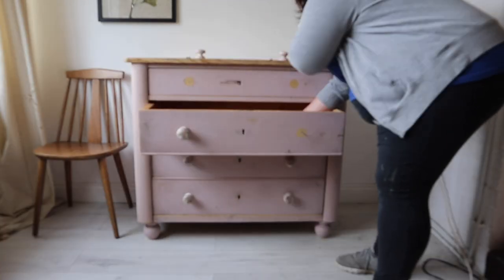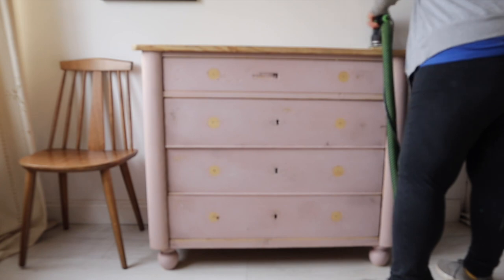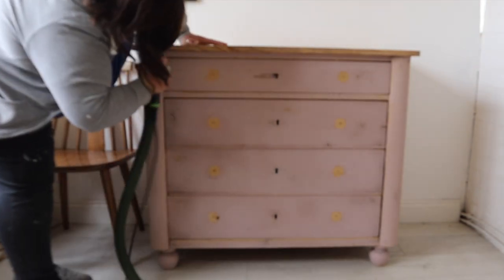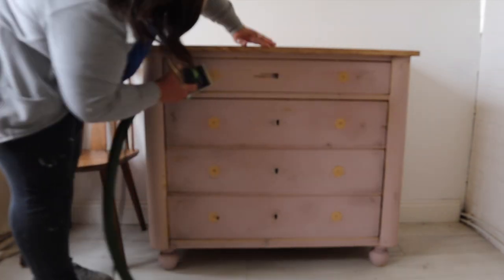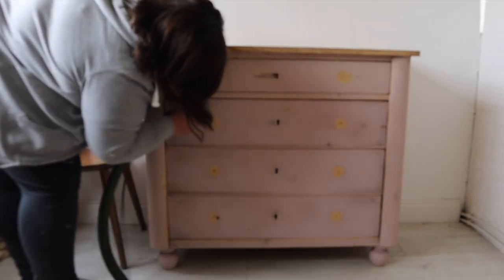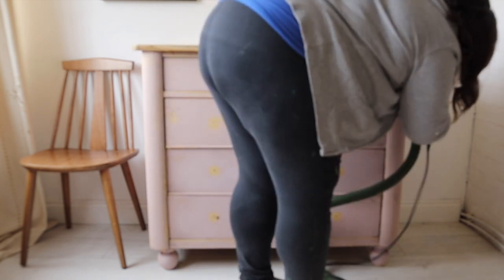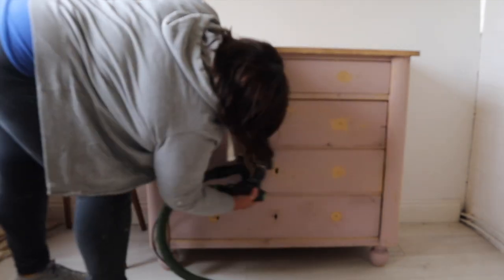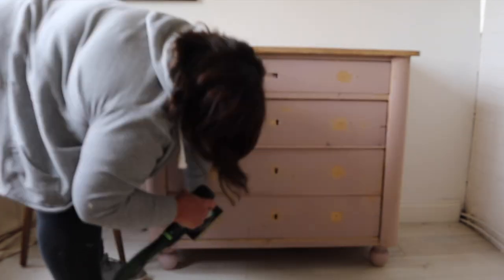The first thing I'm going to do is take those original handles off — I'm actually going to change the handles this time — and then I'm going to give the piece a light sand. The reason for that is when I painted these last year in Conch, I did a chippy effect using Sea Spray and distressed it back to reveal the pine underneath. I don't want that kind of look for these, so I am going to sand that Sea Spray texture right off using my electric sander to give a slightly smoother finish.